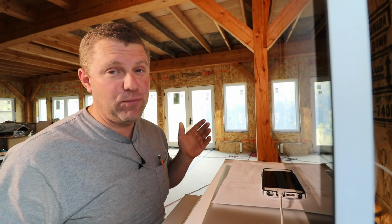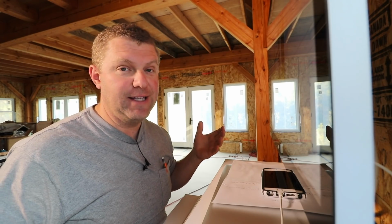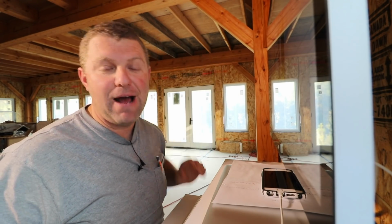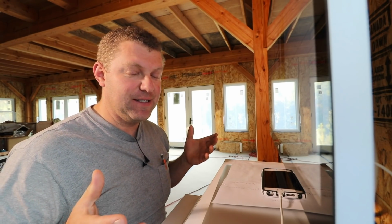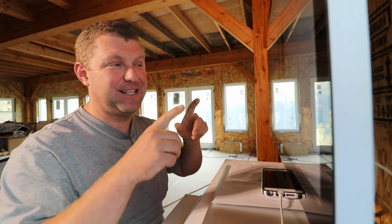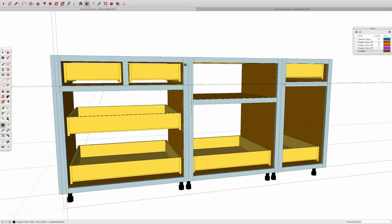So a lot of the time went into drawing the first drawer using those constraints that the hardware gave us, and then it's a matter of just dragging them around and making them fit the box. Thankfully, the manufacturer of these slides gives you a constraint that's really easy to work with. It's basically the opening, this dimension here, which is the face frame, and then subtract 5/8 of an inch, and that should be the outside dimension of your drawers.